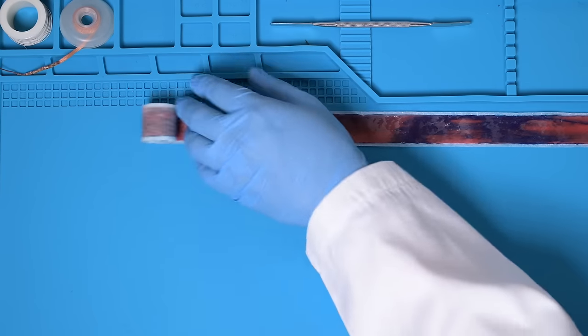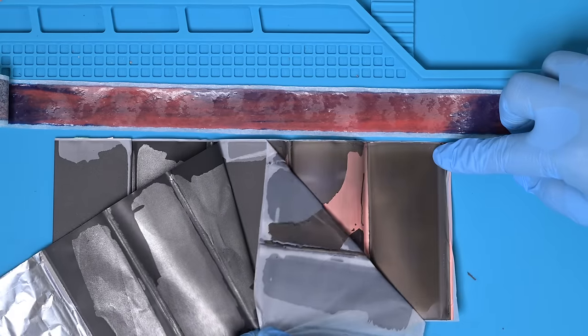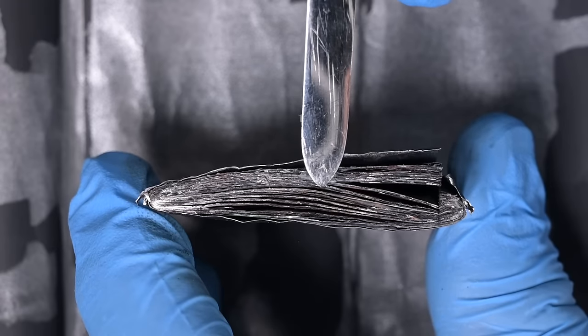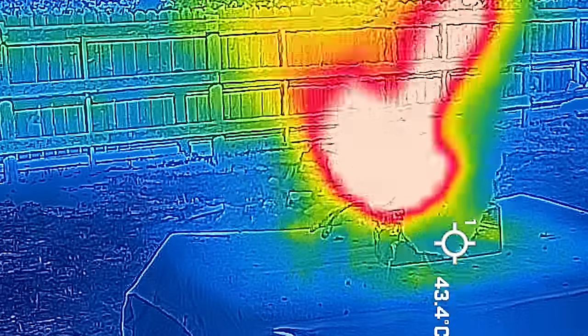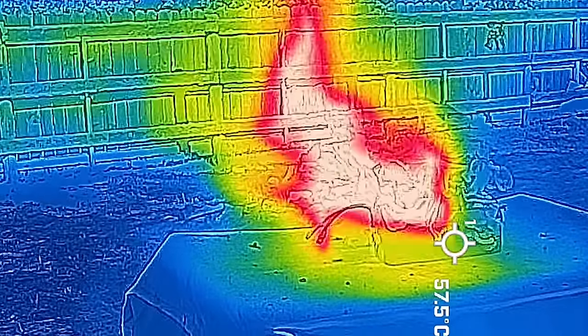What the heck is thermal runaway? A lithium-ion battery is like a tightly packed fruit roll, where the insulating liner is coated with super thin metals and chemical slurries. The battery's pouch is filled with a gel-like electrolyte, which gives the lithium ion something to travel in. The insulating layer is very important as it prevents the positive and negative layers from touching each other and creating a short circuit. If you stab a battery, you may electrically connect those layers, and that makes a short circuit. All the energy stored in the battery will immediately try to flow through this short, creating lots of heat. And if the reaction gets hot enough, the electrolyte starts to decompose into flammable vapors. When the superheated vapors encounter air, they spontaneously combust. This creates more heat, which vaporizes more flammable electrolyte, and creates a self-sustaining fire, also known as thermal runaway.